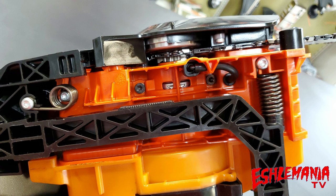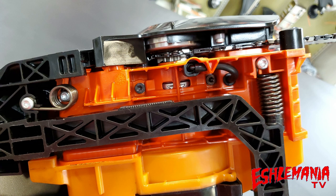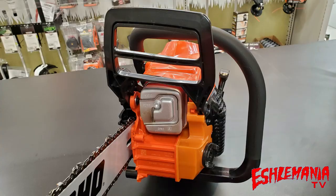Also looking in from the bottom, you can see the sprocket is to the inside, closer to the engine, and the clutch is on the outside, further from the engine. This helps change the gyroscopics of the chainsaw — moving the bar and chain closer to the center line gives better balance and improves the feel when you're rolling the saw from side to side, making it feel lighter than it actually is. Put the bar on the outside and, even if it's not a lot of weight, it will feel like much more because it's further from the center point.